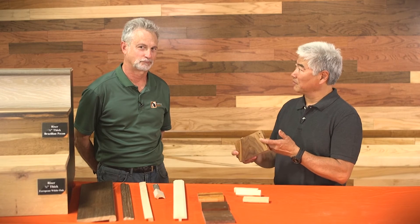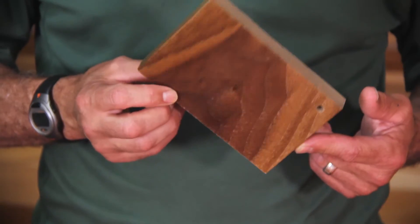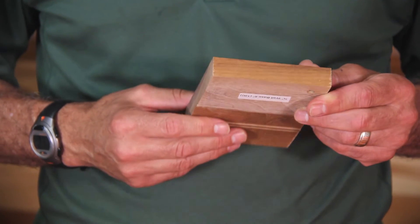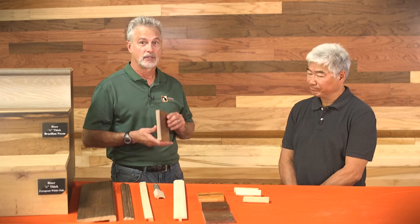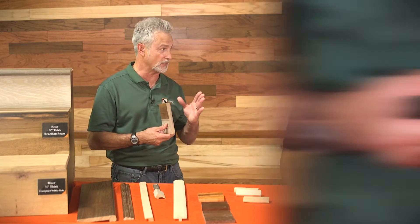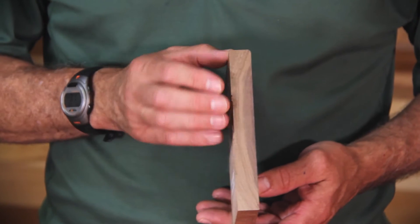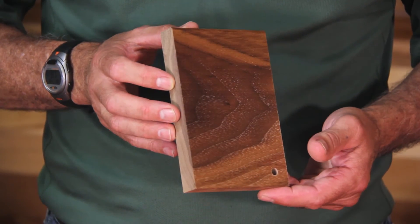This is a white piece of wall base. And it all goes back to function. The thickness of the wall base eliminates the need for quarter round or shoe. Since most of the wall base today is getting thinner and thinner, perimeters of rooms still remain an issue, which is why the quarter round is used. So this three quarter inch thick wall base enables it to take care of that expansion, and it keeps it consistent with the look of modern.